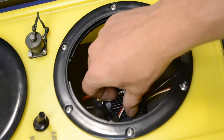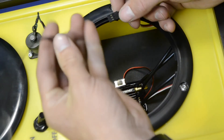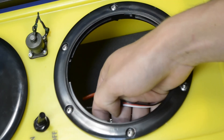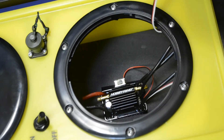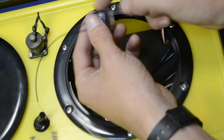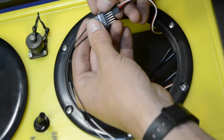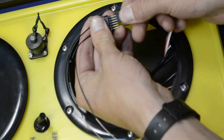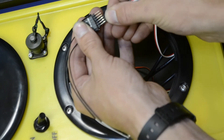When plugging in a new receiver or an existing one to the speed controller, each receiver will be on the side of the pontoon that has the labels, either Sea Floor or Hydrone, on the outer edge of the pontoon. It'll be towards the left on the left pontoon, towards the right on the right pontoon. It'll plug into channels one and two, with the left side being one. Make sure that your white wire is facing the channel number, and there is a small chart on the receiver to tell you which channels are what.